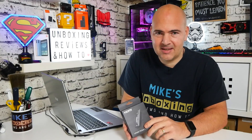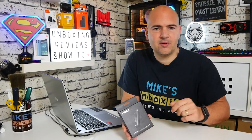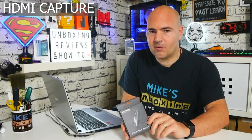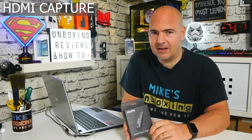The Lumix G80 is a pretty expensive device, around about the £500 mark, so obviously it is going to capture extremely high quality directly to the SD card. Through the conversion factor of HDMI into USB 2 — and it is only USB 2, unfortunately — you're going to get lower bit rates, so the footage may look a little pixelated.